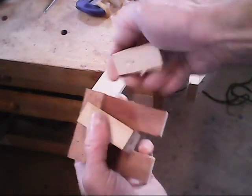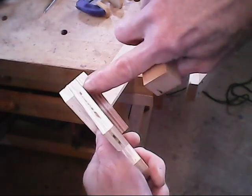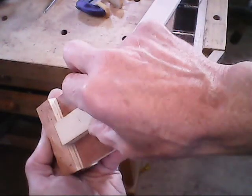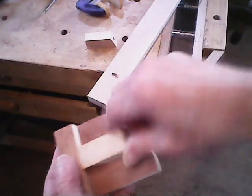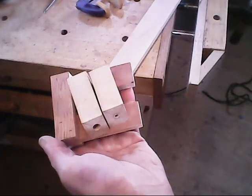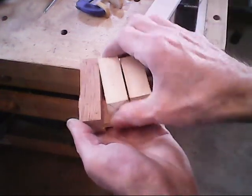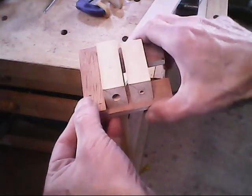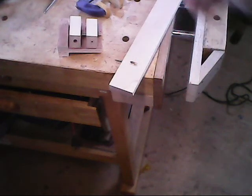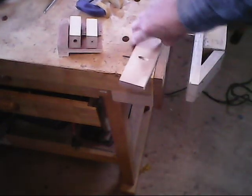So you can see how the jig works. It's just a matter of building two blocks and then making this little fixture right here. This is referenced off the edge of the workpiece because we cut the blocks even with the edge of the workpiece when we did the first part of this. Just slide it in, there's your fixture — take that block out, put the next one in. That's the complete system right there. It does require two drills. This is only so that we can do pocket holes with jobber drills — no need for a step drill with this system. The system is just to use jobber drills if you don't have a step drill. But it does work — it's a makeshift jig, and it does work.